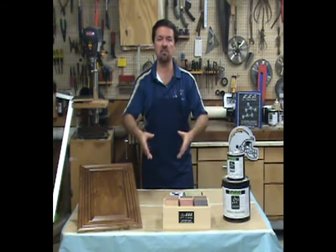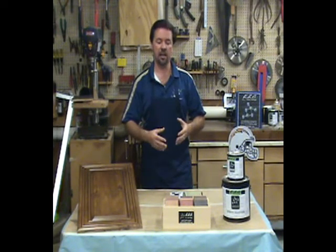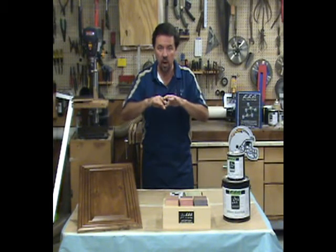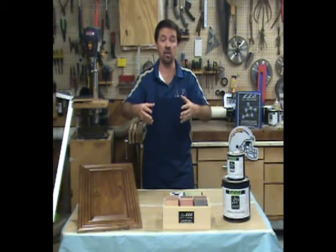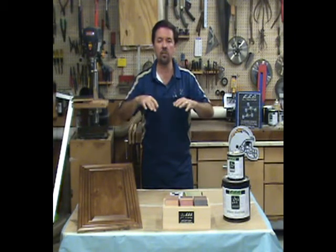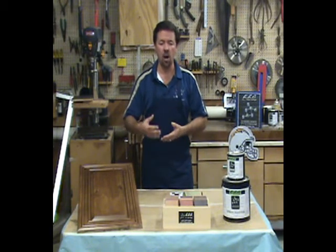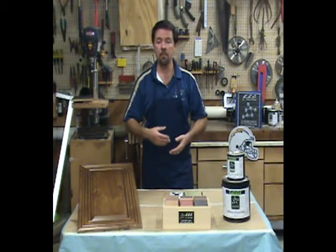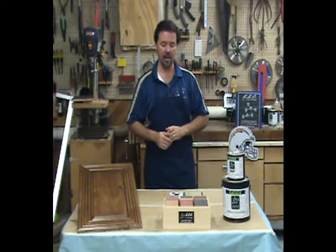They'll fall through that, disturb the coating, disrupt the coating, spill. Now when you cross-link something, instead of using chain link fence, that chain link fence turns into chicken wire, real tight little squares. Throw those same ping pong balls or stains and impurities on that, they don't go through it. It's such a tight woven film, nothing really penetrates it. So that's the benefit of a self-cross-linking product. It's almost analogous to something being catalyzed or pre-catalyzed, but kind of at a different level from that one. It actually almost steps it up one level from that.